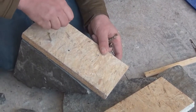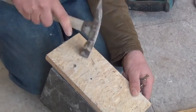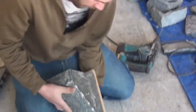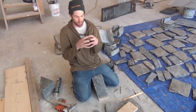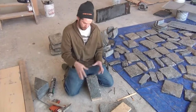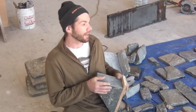With the deck screws, there they are — I've got it upside down at the moment. When we go to install it, we're going to leave this overnight with some pressure on it so that glue can cure. That PL 500 adhesive is unbelievable — if you were to try to pull two landscape stones apart, you'd end up blowing out the stone before you ever broke that seal. So we'll leave it overnight and tomorrow we'll make a quick video of installing these corbels on the fireplace.